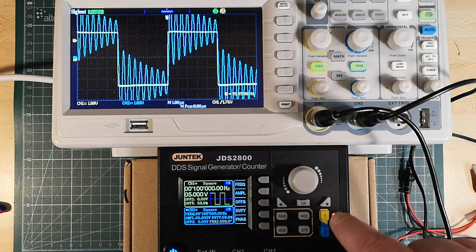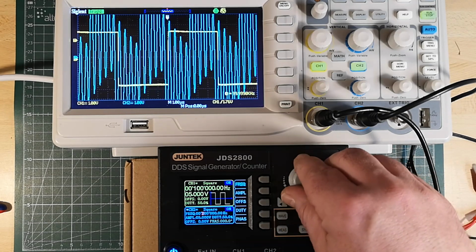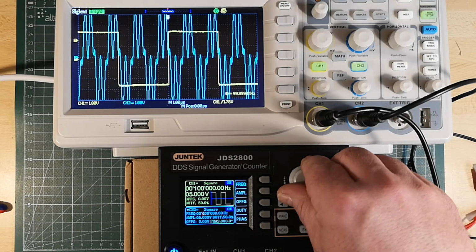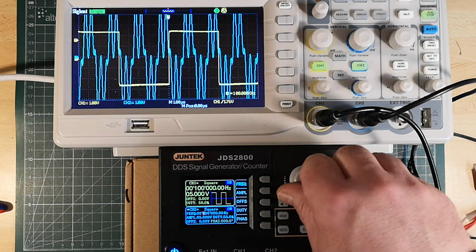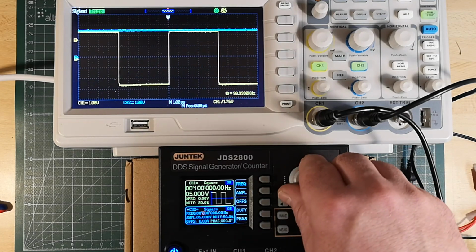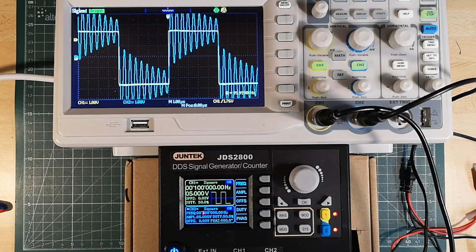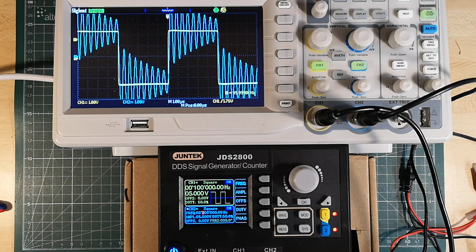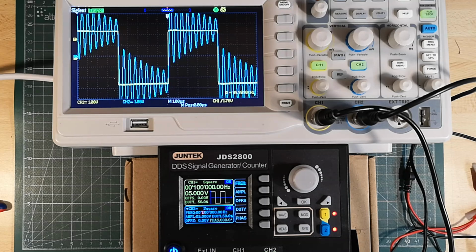And if we just increase the frequency, you should see it's getting worse and worse. So this is not looking anymore like a square wave. So you see the square wave signals are a lot more affected by the quality of cables, quality of connections, the shielding or inductions, or even when I put in, let me see, I think one of my boxes should be a capacitor.